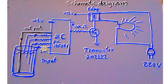The other three wires are inputs, each with a 2kΩ resistor connected in series. We have used the PIC16F676 microcontroller. There is a 10kΩ resistor connected to the base of the transistor. The transistor is the 2N2222, and we have used a relay — a 12-volt DC power relay.